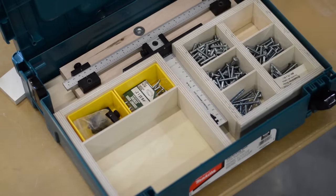So I get started by unbolting the motor and squishing it over closer towards the storage tank. And there's just a copper hose that connects the compressor pump to the storage tank, so that just kind of bends a little bit. And the second step is to cut off the handle. And next I filed off the burrs to help protect my sensitive skin from any ouchies. And I drilled two new holes for the motor and bolted that down. And it passes the shake test, so it's good to go.